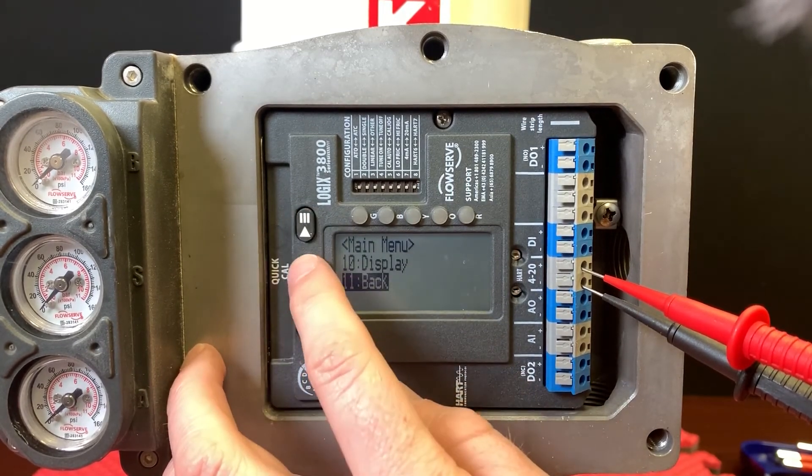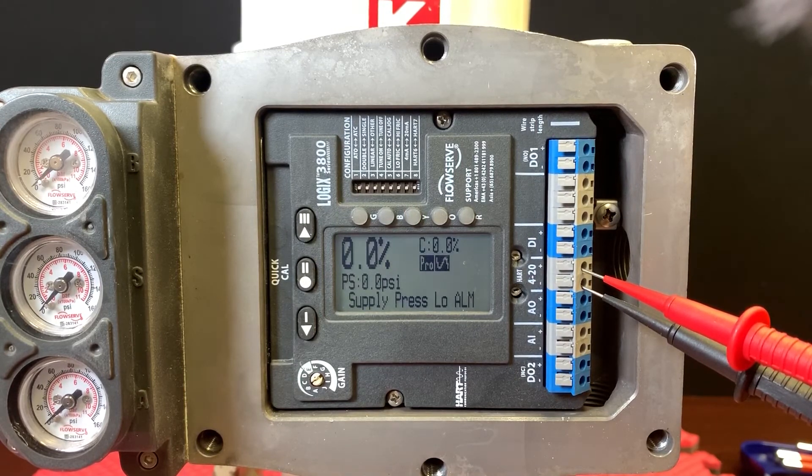In general, this gives you a great user experience with a positioner that's well founded in actually controlling your valve as expected. We do get the typical gauges that allow you to see your supply pressure as well as the outputs to either the single-acting side or both sides if you're running double-acting. That still gives us the feedback of knowing whether the valve is shutting off and whether all the air is going to the correct side — all those traditional pneumatic indicators that tell us if the positioner is working as it should. With that, that's really the introduction to the interface of the 3800, and we'll be putting out other videos on calibration and a deeper dive into the menus, so stay tuned.